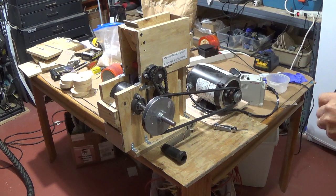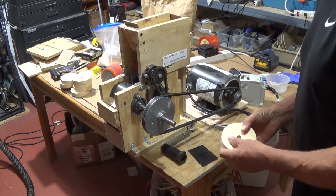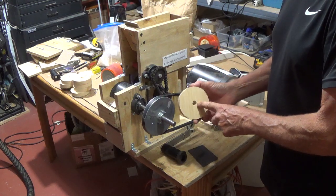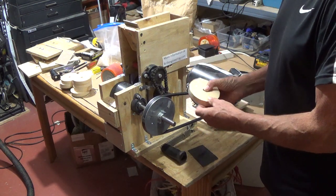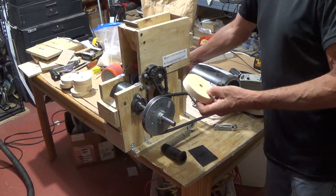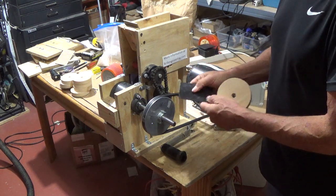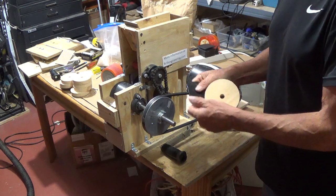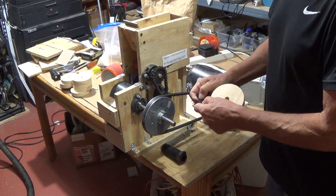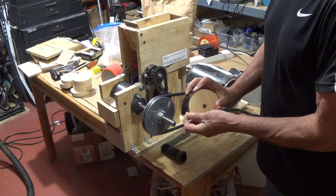This is Don Brill with Brill Engineering. We've taken the pinch roller and I came up with an idea: what if we could make rollers out of wood that had a center hole in them that would be a half inch? So instead of taking one of the polyurethane rollers like this and centering a shaft in it, I could show you how to make one of these. This is a urethane sheeting that's 90 durometer, so it's hard — you should not be able to make a mark on it with your fingernail. If you can, it's too soft. Then we would take it and glue the polyurethane sheeting like this.